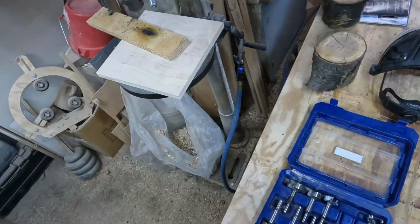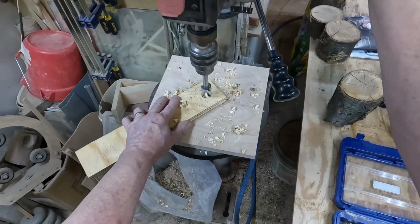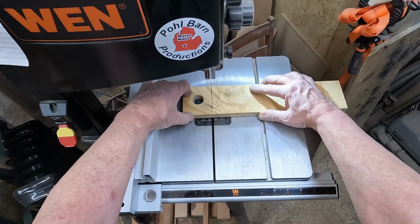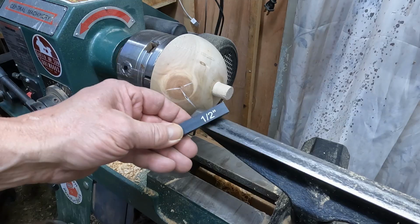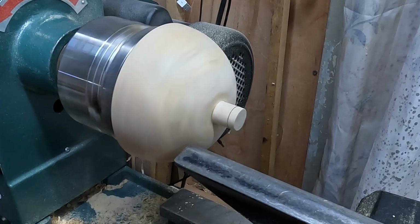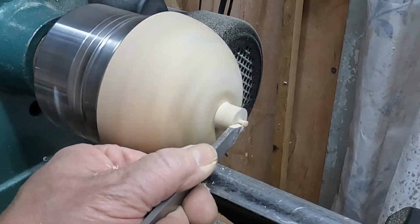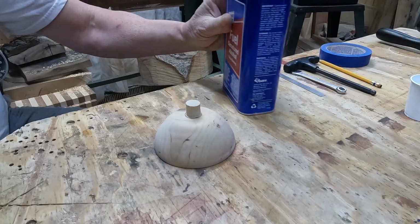First, a hole larger than the dowels needed to be cut in a piece of scrap thicker than the longest dowel. I chose a piece of 3/4 inch scrap plywood, drilled a 1-inch hole in it, and cut it into a rough square. All of the dowels were cut to 1/2 inch, and each piece was engraved after setting the 1/4 inch clearance on each one. All 6 pieces were numbered and entered in the logbook as one entry.